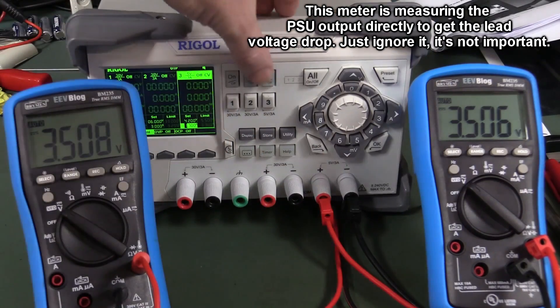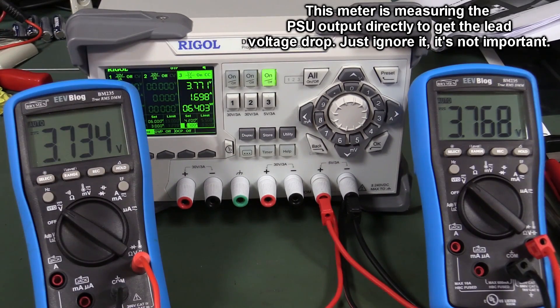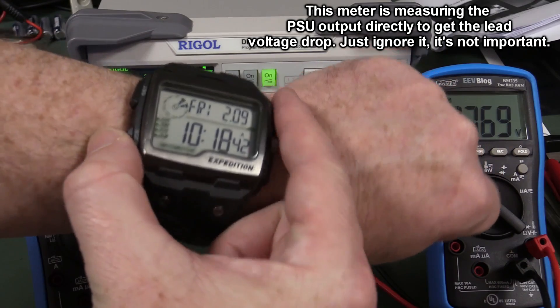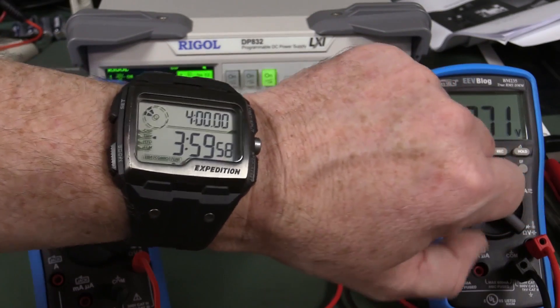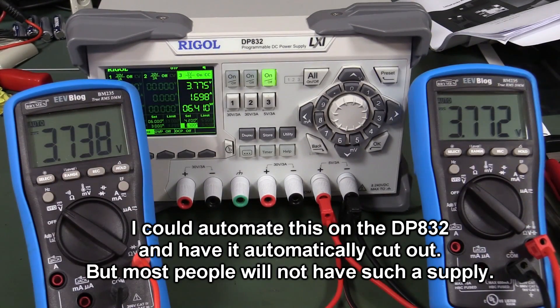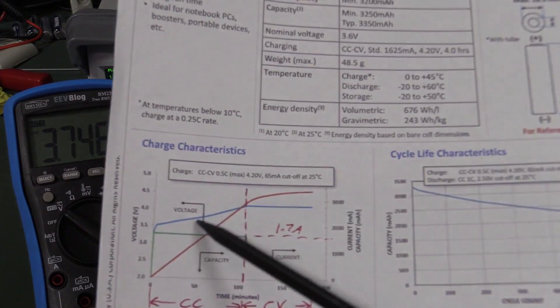Let's switch this thing on - make sure you've got the battery in the right way. And let's switch it on. Bingo! 1.697 amps. We also want to set our timer - I've set it to 4 hours. Let's start that. It'll count down and beep at me at the end of 4 hours, because you don't want to leave this running overnight. You can overcharge the cell and damage it - you don't want to do that even though it's sort of self-limiting. You want to cut it off after that nominal 4 hours. What you can see is that the voltage on the cell is slowly rising with that constant 1.7 amp charge on there.